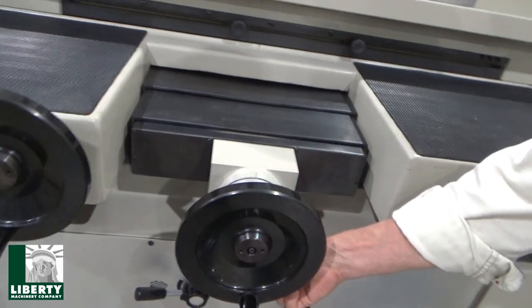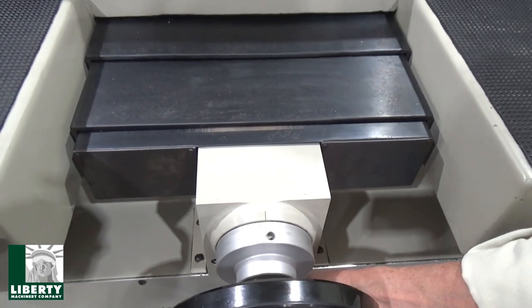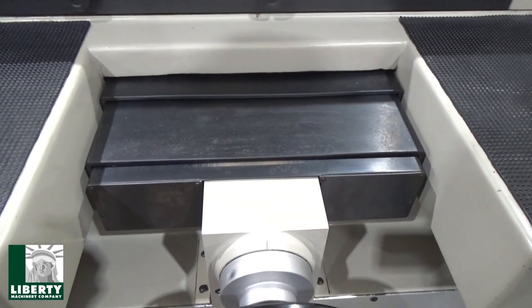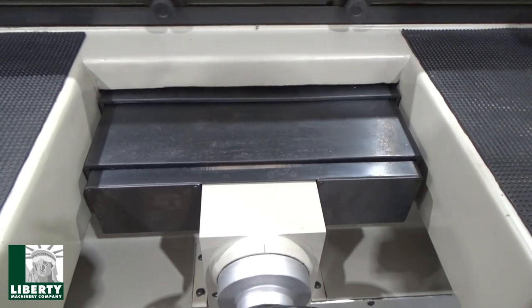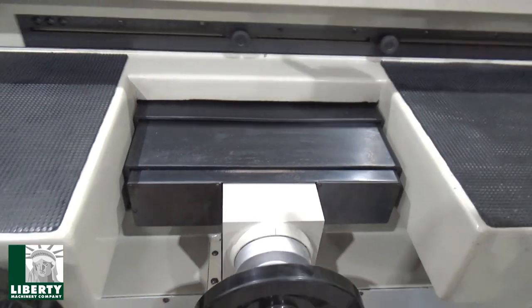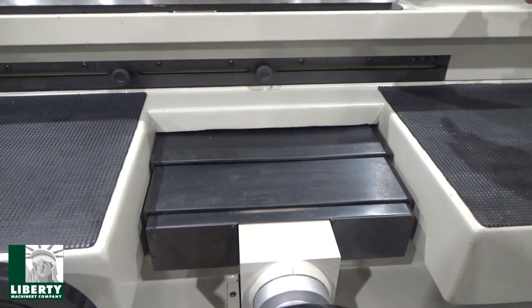Come back up here now. I'm going slow here. And really, it's just a hydraulic speed control. It'll do the same thing. It'll traverse back and forth. Notice how when it stops, it waits for the table to finish its one reset so that you don't be moving on top of the part. Yeah, it knows, it waits for the switch to make.